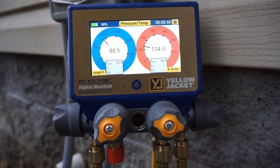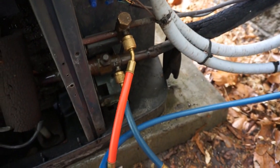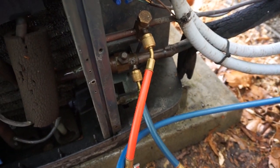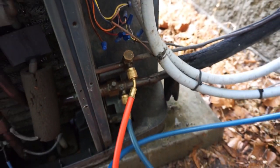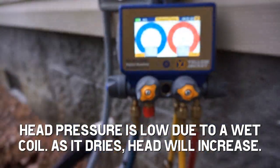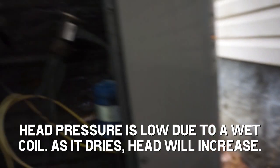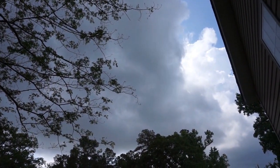I have the P-51s hooked up. We're following the pressures here and I've got to get everything else hooked up. I have the probes inside in the ceiling that I have to hook up — the line temperature probes out here. Our coil is still probably going to be a little damp, so we'll let it run for a few minutes to dry off the coil as well. And we have an angry sky coming, so cross your fingers.